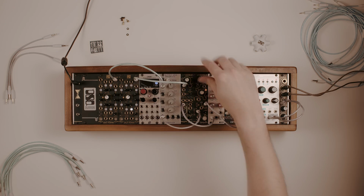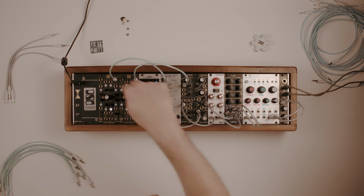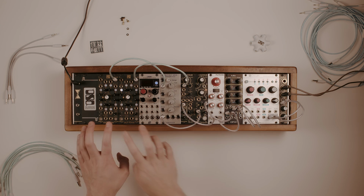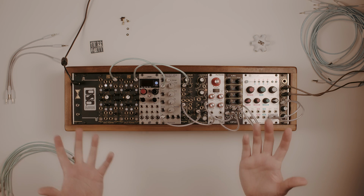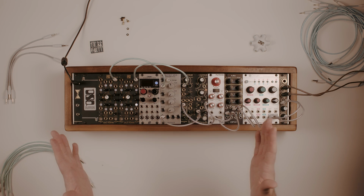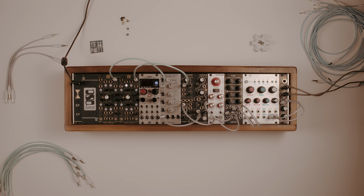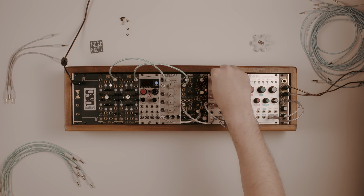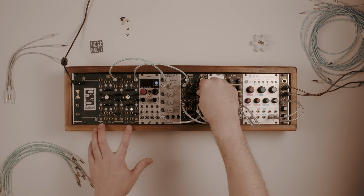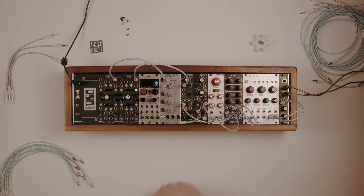So there will be a limit here because the CV output of the octone itself is limited to 0 to 5 volts. So we've got this 5 octave range, and this bias will sum with the step point, but it will max out at 5 volts. But I find that's generally okay because, for a musical sequence or a musical melody, if you're stretching beyond an octave, especially beyond 2 octaves, you're pushing what's going to be particularly musically useful, I would argue. So if you keep the first couple of octaves for your actual sequence position, then you can easily tune up an octave or two without hitting that cap.